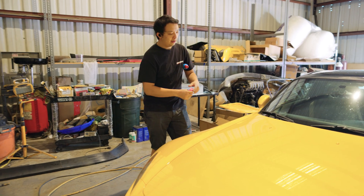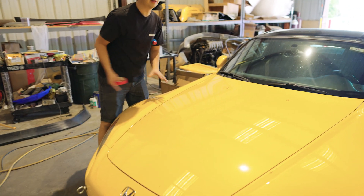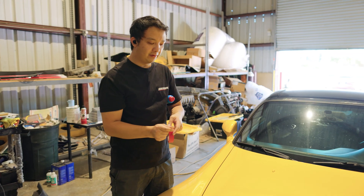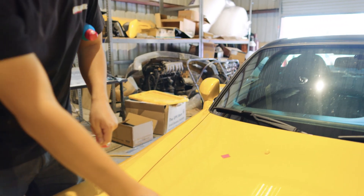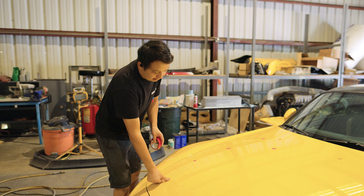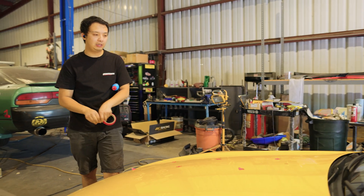With a car, if I have a large flat field like a big hood, the scanner can't tell the difference between one area and another — it's a very simple shape with no features. So because our scanner scans in color, we're going to add the equivalent of reflective markers — just a little lower-tech. I'll scatter masking tape across large areas that have no features. The ARTEC Eva's view distance is approximately a foot and a half by a foot, so I use that to guide my prep. You're going to see this car basically covered in dots.